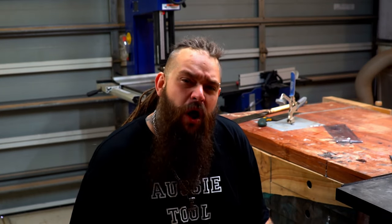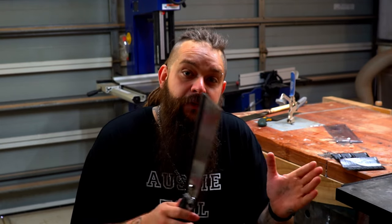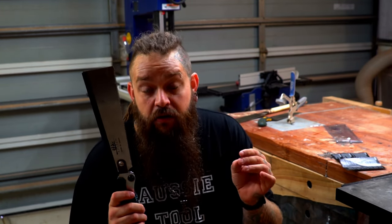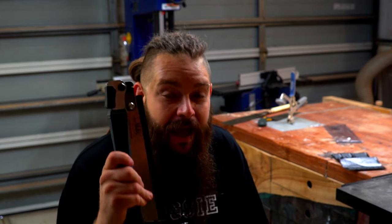At full extension, this blade is very comfortable in the hand and has a very similar size to a traditional handle. You may be thinking you're not one for hand tools — and I get exactly where you're coming from. If I can do something with a power tool, chances are I'm likely to do it over using a hand tool. But because these Japanese saws cut on the pull stroke and have such a fine blade, they take a lot less power to perform the cut. They're actually very easy to use and produce a very nice cut. I was recently doing some production turning in my shop and needed to cut up a lot of blanks. I started off using my band saw, but in the end I resorted to this saw because it was just quicker and more efficient.